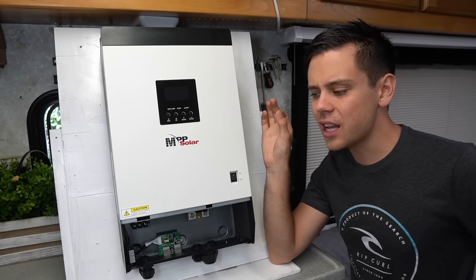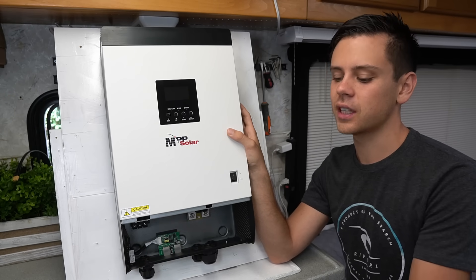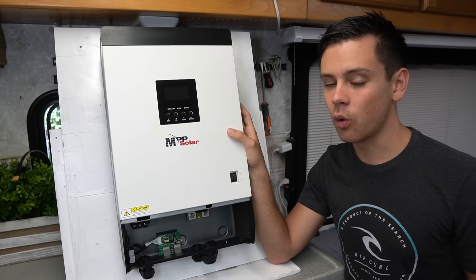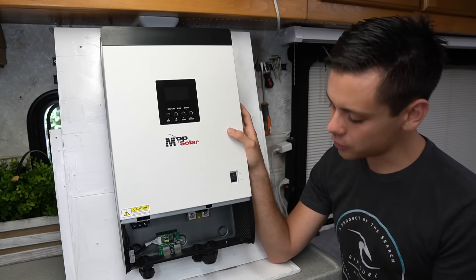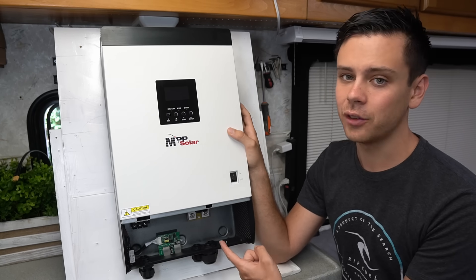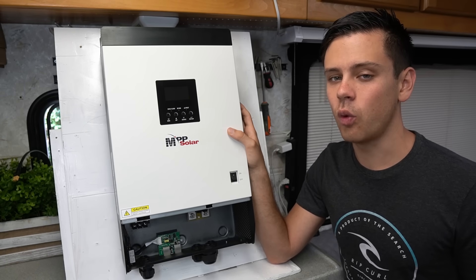You will also save a lot of money if you do a 48 volt system. A lot of people think you need a bunch of six or 12 volt batteries, but you can buy 24 volt AGMs or lithium iron phosphate batteries and just put two of them in series, so you could spend a lot less money. The wire savings is huge too — running at this high of a voltage compared to 12 volts will save you around $100 in wiring costs.